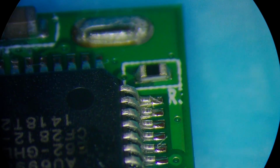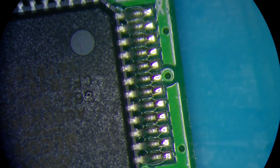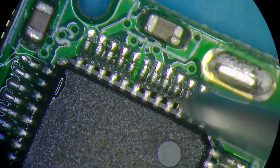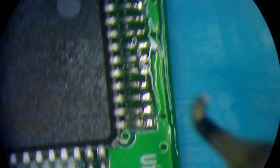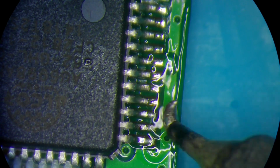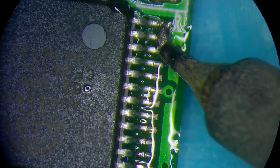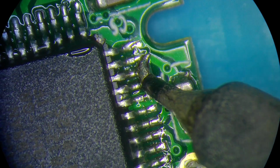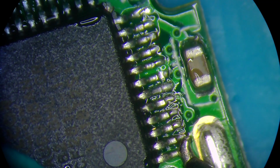Yeah, this, I'm not sure that that would have come loose, but it might need some extra solder as well. So I'll just dab a bit more here and here as well. So just to be sure, I don't think there is a problem with these ones, but to be 100% covered on all of these aspects, it's best to just pay a little extra time and reinsure that everything is attached. Because all it's gonna take is just one header is gonna be disconnected, and if that is a vital signal, well, communication will stop.